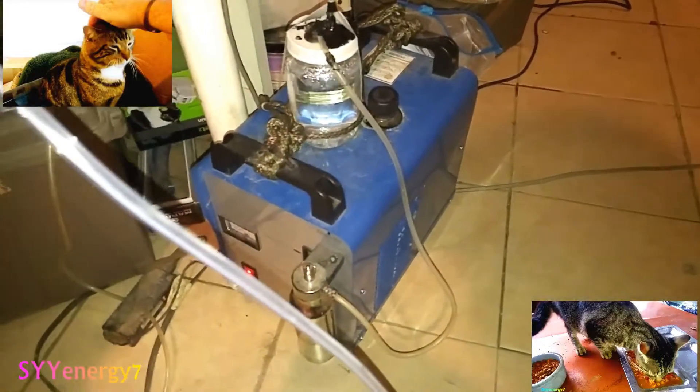Because there's probably a few days I was using this and it wasn't really working — the air wasn't coming, the HHO gas wasn't coming out. So I figured I'd warn you on this. There are better bubblers out there that you can buy, but I didn't have any problem with that mason jar thing — I got like a dozen of them with silicone gaskets, they were cheap off Amazon. You should verify that the HHO is coming out when you put it in the water like that so you can see it working, because there is more resistance to push through this versus just going through that stone diffuser.